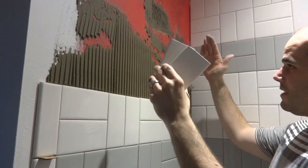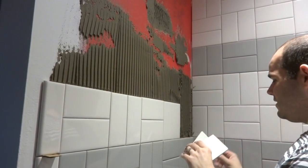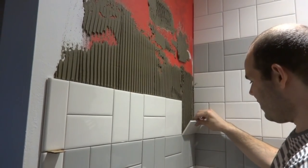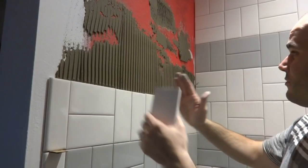When we put the boards up on the wall something was a little off, so now the wall is not exactly 90 degrees. I'm finding myself having to slightly trim just an eighth of an inch off the end of some tiles. I'd recommend no matter what side you're doing, work from the center out.